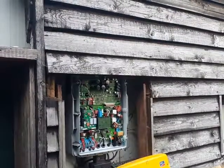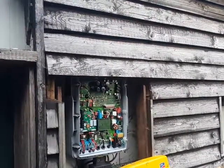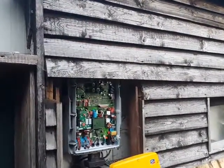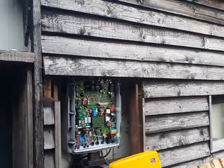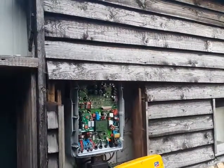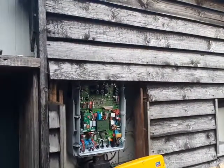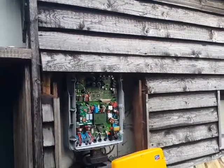I did some research on the internet and on a German forum. There was someone suggesting that UCE could mean the voltage of a collector emitter of a power transistor. Very possible, I would say, because there are power transistors inside. The power transistors are called IGBT, and there was another person who had SMA replace a board with chips, as he was saying.